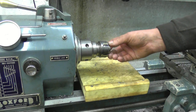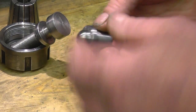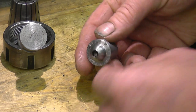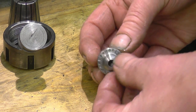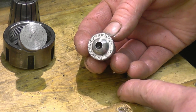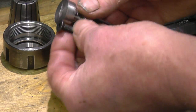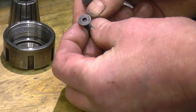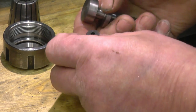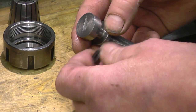I'll use this bit here to practice how I'm going to do the end of that. I've had a bit of a mess about with it — the end that I've parted off, the spare end. I drilled it and tapped it and put an 8mm domed head cap screw onto it and had a good look at indexing around the outside, but I'm not happy with that. What I'll do is drill it and tap it 6mm and screw that in so it ends up flush — that'll be used to drive it. It's a smaller Allen key but for all the usage it's going to get, it'll certainly do the job. That'll be set in through there, countersunk flush, then I'll index that.